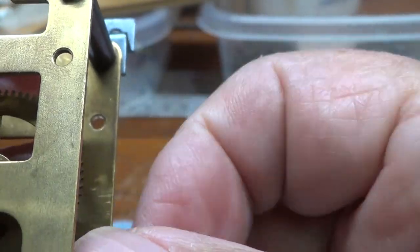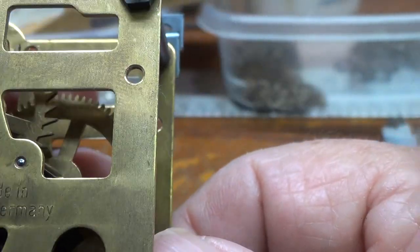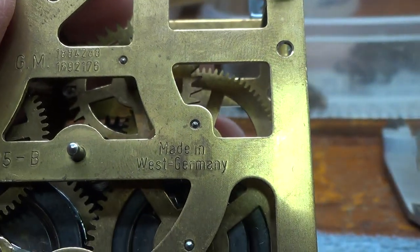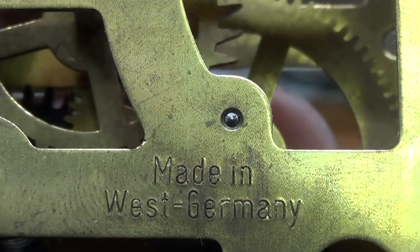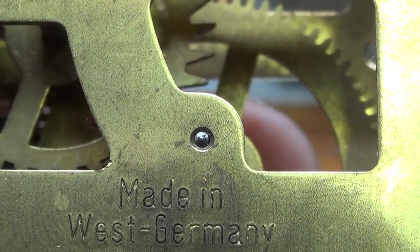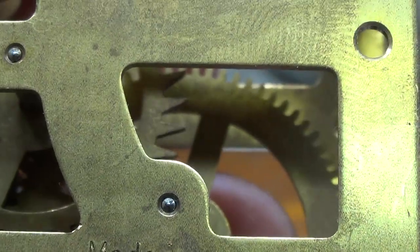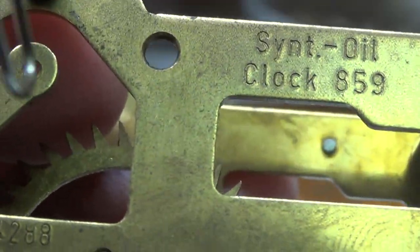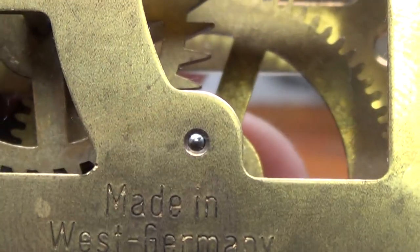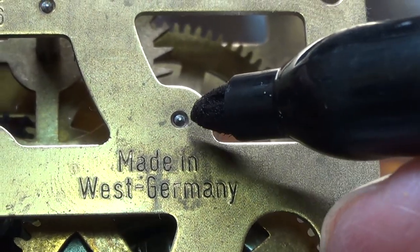We're going to want to have this thing fixed so it runs for a very long, long time. Look at the second wheel, it's usually one that's mangled pretty good. Let's see how the second wheel is on the time side. Yeah, it's not worn much at all, but it is still moving. That's the main. Okay, so the worn side is this side.